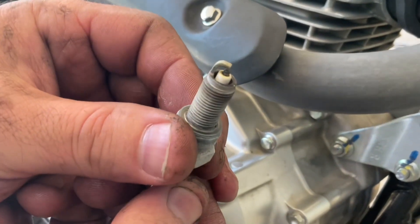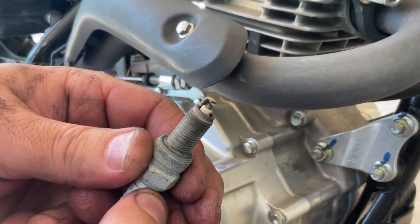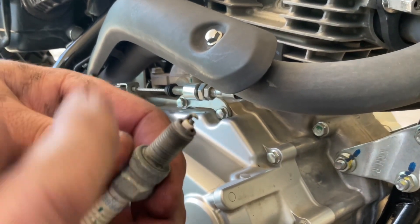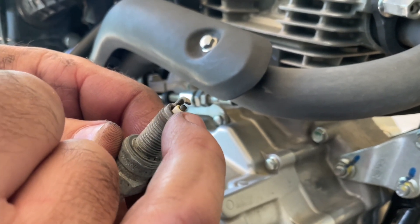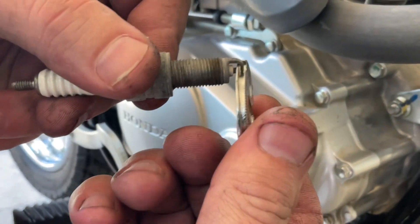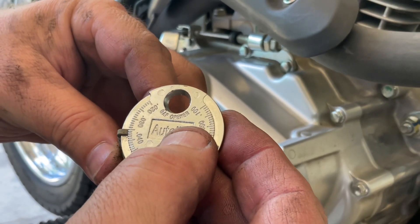As you can see it looks really good — it's got one little dark spot right there, but that's normal. I will probably buy a larger main jet and do some testing on that because there's a little power left on the table by looking at that spark plug. The white part is your porcelain, and the part sticking up is your electrode — the spark arcs between there. We're checking the gap and I'm right at 35 thousandths, which I believe is the spec for this one.